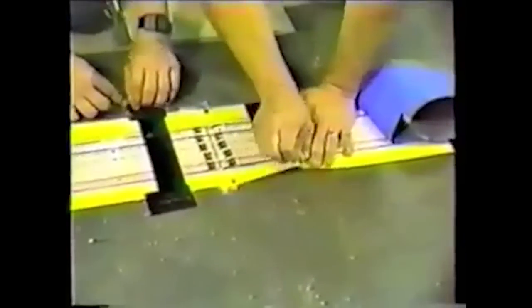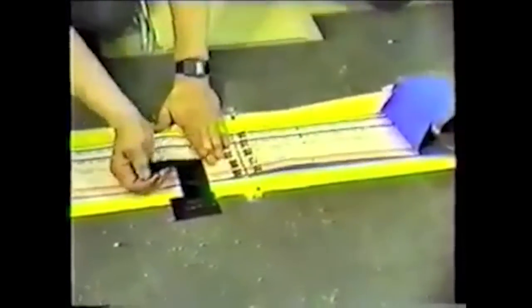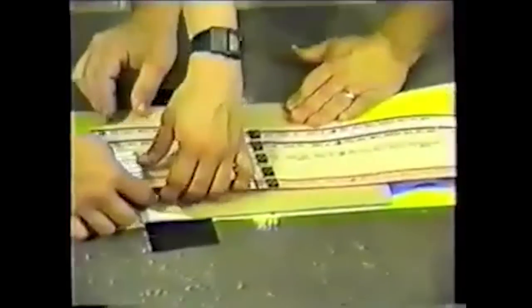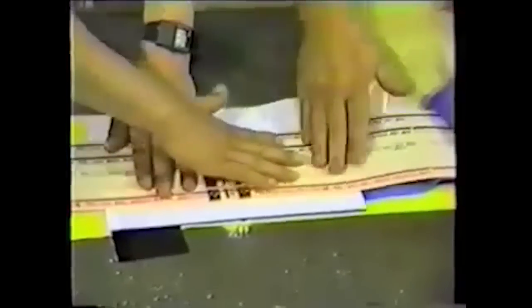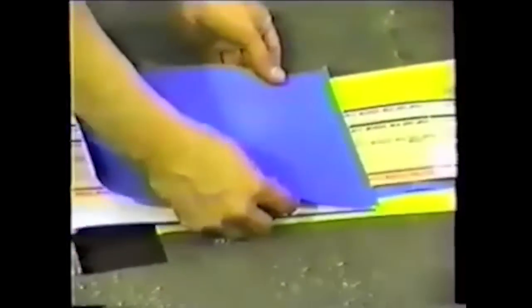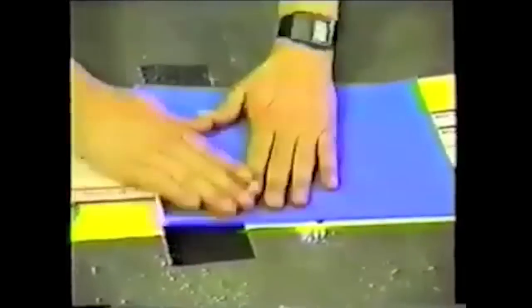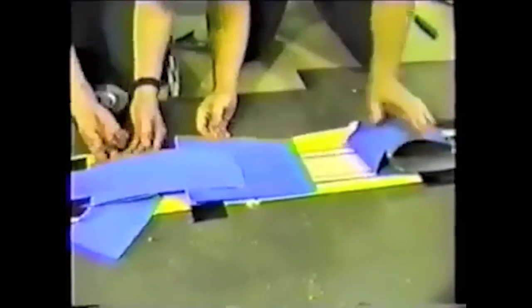After all conductors have been terminated, remove both strips of tape used to cross-tape the cable. Install an insulator patch over the spliced conductors. Be sure the insulator patch is positioned between the bottom of the cable and the bottom blue vinyl shield. Install the top and bottom blue vinyl shield back over the cable, overlapping the vinyl on top of the insulator patch.